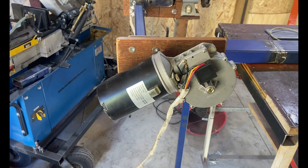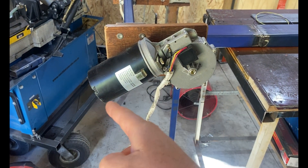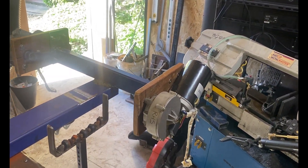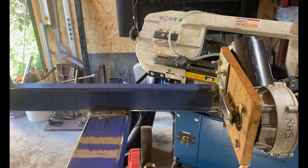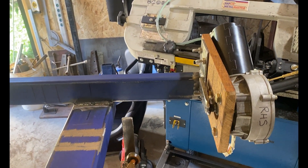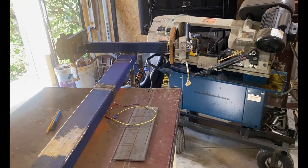We're looking at our left hand side front motor here. If I was sitting in the rig and looking forward, this would be the left hand side motor. You'll see that it ends up at a 45 degree angle this way. On our right hand side motor — of course they're both left hand side wiper motors — this one installs at 45 degrees this way. It just means that in the SMC3 utility software and your sim tool software you have to make some changes, because they're both left hand side motors. You have to reverse the axes in the software for this to operate up and down the same as what this one operates up and down.